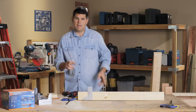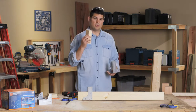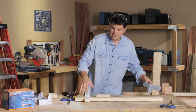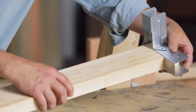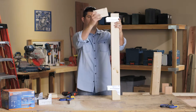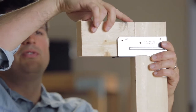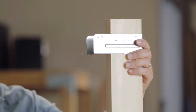The next one we have to do is at the very top, and a good tip is to use the actual lumber you're using as a guide. Once we slip on the bracket in the same orientation as the lower one, put your lumber in — this is going to be the direction the lumber goes. Match it up right to the top so it's flush. That means your work surface — that half sheet of plywood cut in half again — is going to be perfectly flat.